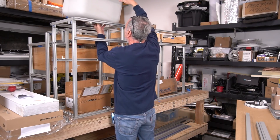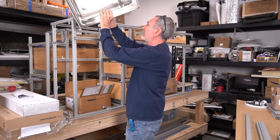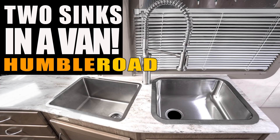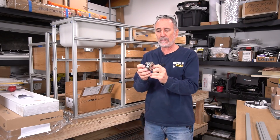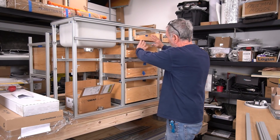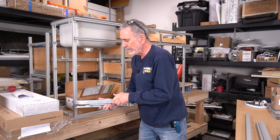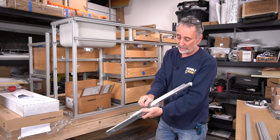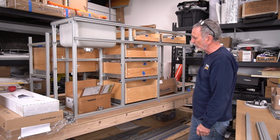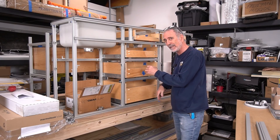Look at this sink — this is a beauty. I've got a nice big sink going in here. These big sinks are taking over the industry. We've got some really nice fully stainless steel latch-locking handles from the boating world going over both of these. These Blum drawer glides are hidden. Blum drawer glides are quite nice because they're very adjustable in X, Y, and Z — high quality stuff. In this case they're soft close and we can adjust that soft close to take the latching, so just a nice little close and it'll latch on its own.